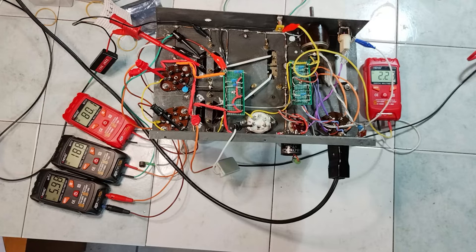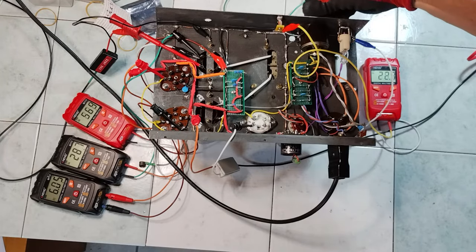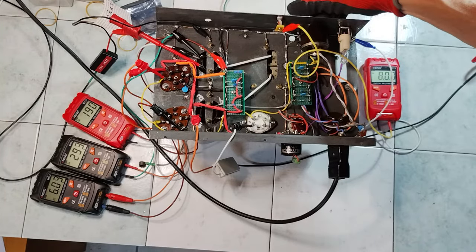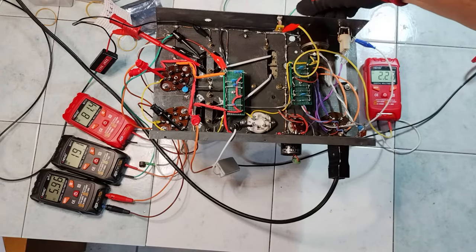The reconstruction, after the power supply, starts from the RF tuning and amplification stage. Initially, instead of the field coil and of the output transformer, equivalent dummy loads are temporarily used, especially for the purpose of determining the correct value for resistors. It is important to be able to observe some voltages simultaneously.